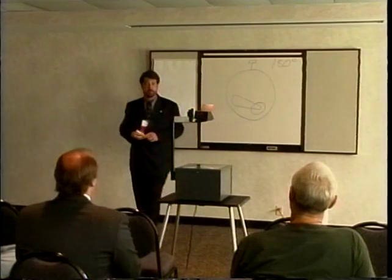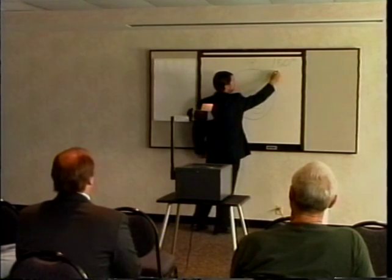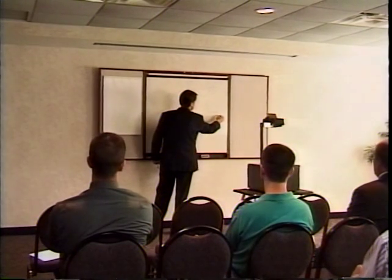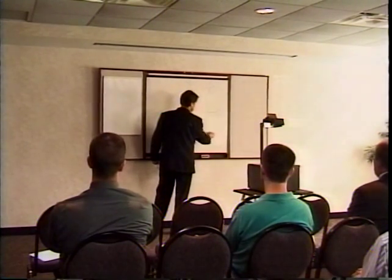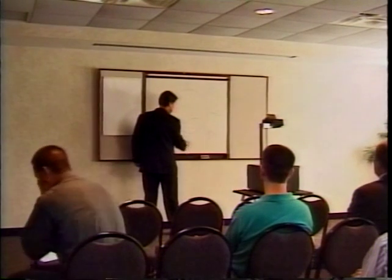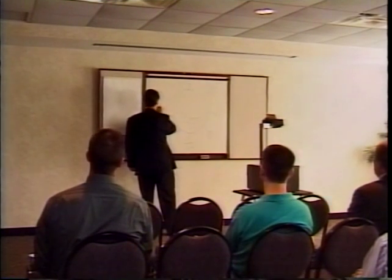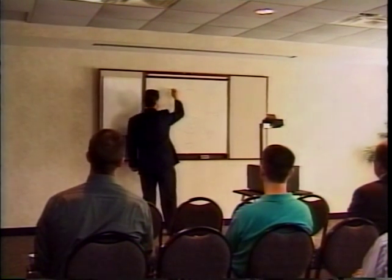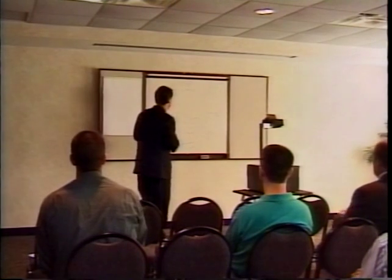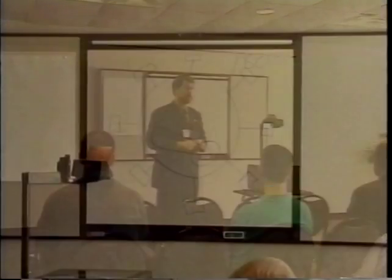We want to time the watches in eight positions, using the stem as a reference. Stem up, and then about the 1:30 position, 3:00, 4:30, 6, 7:30, 9. Well, that stem's getting longer and longer, isn't it? And 10:30. Take those readings in all eight of those positions, compare them.